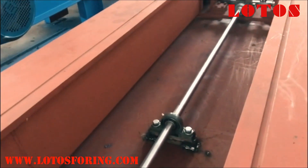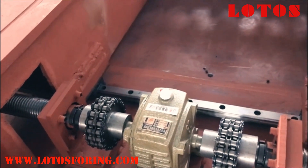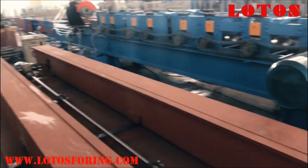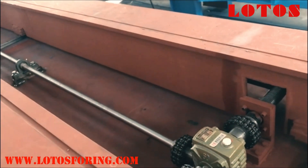Mill bases must be capable of accommodating recirculated lubricant used during forming. In the case of split bases, attention has to be paid to providing recirculation to each base section and to making a watertight joint between the bases.